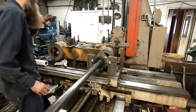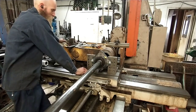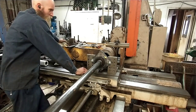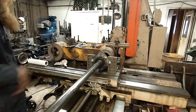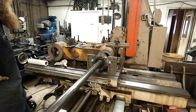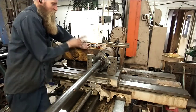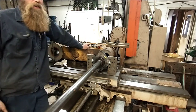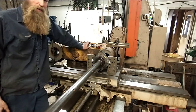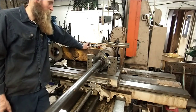I've been looking at this thing on and off and working on other projects at the same time, and I've got several hours into getting the setup through this. Part of what I'm fighting here is I discovered I was trying to follow the original bore, and then I found very strong evidence that someone had welded and re-bored this thing before and got off-center through the original bore.